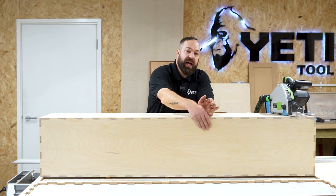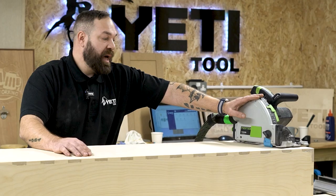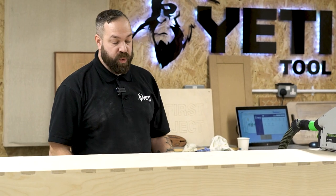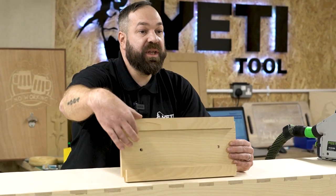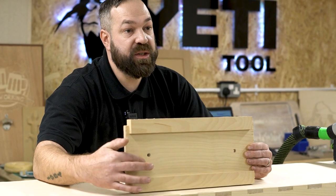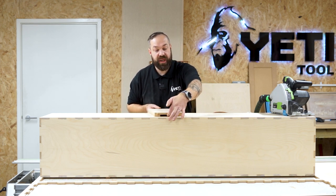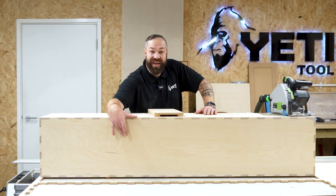We've got the box fully assembled and all joints glued, everything fitting together really nicely. We've sanded off any excess glue remnants and made the joints nice and smooth. The next step is separating the lid from the main box body — I've chosen to go around with a plunge saw to trim that away, but just as with the Z-head project you could use a hand saw, jigsaw, or circular saw. We also created inside gussets to hold the upper part of the X-beam, and I've added some ribs on the inside to create a space for the split nuts and washers to sit, plus a cavity underneath for the extra accessories. Now I'm going to roll this over and cut around the perimeter to expose the lid from the main case.